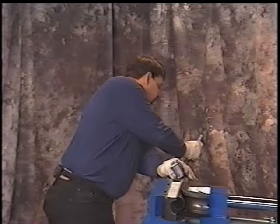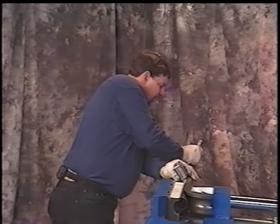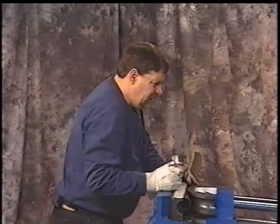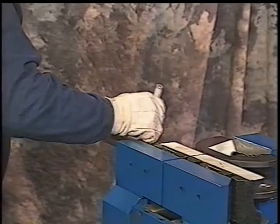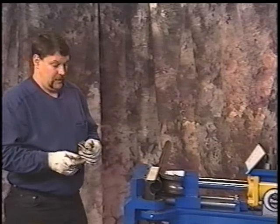We'll make our marks now. Shows we've got a mark at 6, got a mark at 11 1/2, we've got a mark at 19 1/2, and then we have a cut at 30. What I said before was we'll make that cut line, we'll extend those marks out just a little bit, so in case you should happen to rub one, you're still going to be able to come across it. But we'll put a couple X's across that. I do that for one reason. That way I know that's where the cut's at, and that's not a bend line. Okay? Put that away.